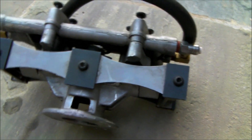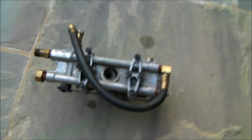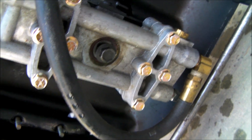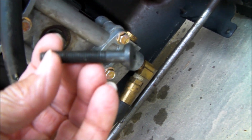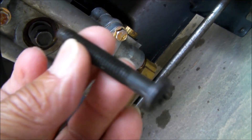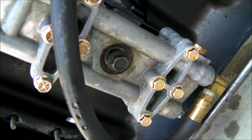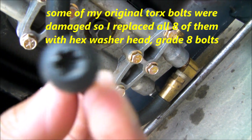I'm just going to replace the pump. So if you're not too handy or you have trouble getting these Torx screws out, you can actually replace the pump — I'll show you which pump will work. Actually, I've decided not to replace the pump. I didn't film much video because I wasn't certain my repair was going to work, but it did. All I did was replace that 203 bearing, and rather than reuse the Torx bolts, I replaced them with grade 8, five-sixteenths, eighteen, two-inch-long bolts. I went with grade 8 so I could really put some torque on them and clamp it down so it doesn't leak. It works perfectly — a $5 bearing and eight bolts to eliminate those nasty Torx bolts.